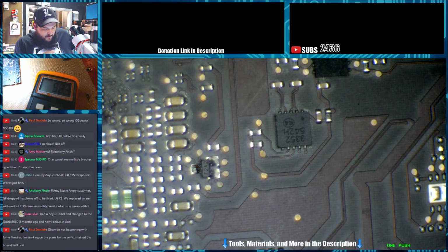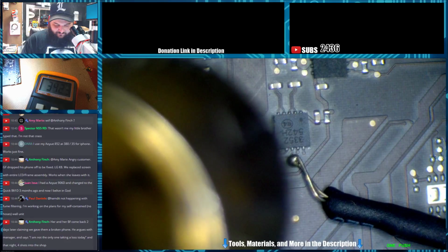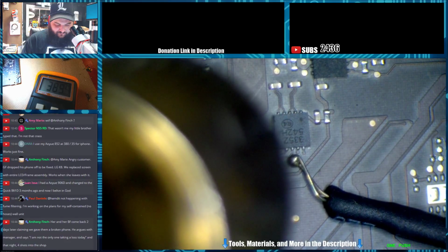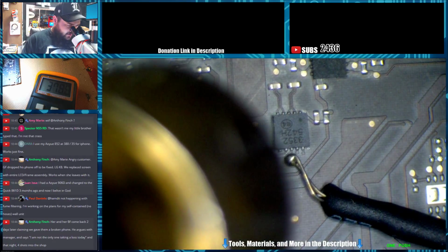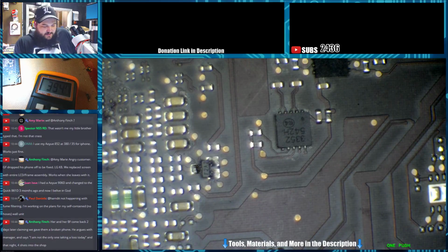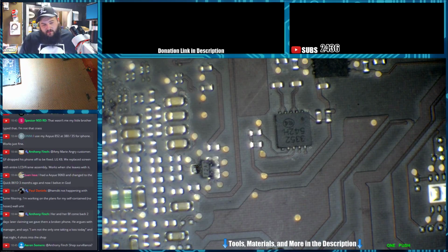So I've bumped it down to 30, which is 20% lower than I normally run. Now let's see. So it looks like it's about 380 at the lower airspeed, so it seems to regulate itself pretty well. It's within a 10-degree range is where it stays. Down in the nozzle is going to be much higher, I think. Yeah, so down in the nozzle it's like 400, 440. But the working distance that I'm at, it's right in that same range. It stays consistent.